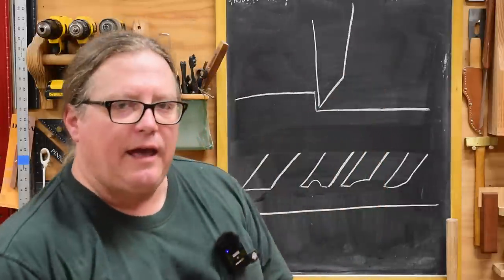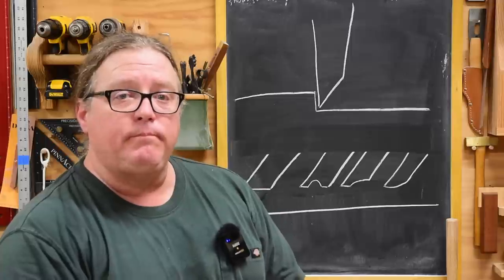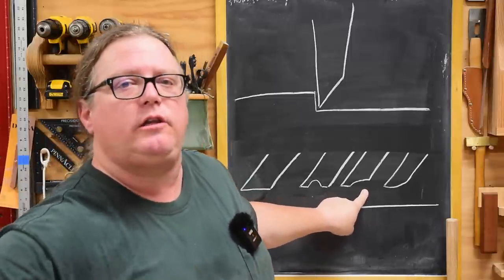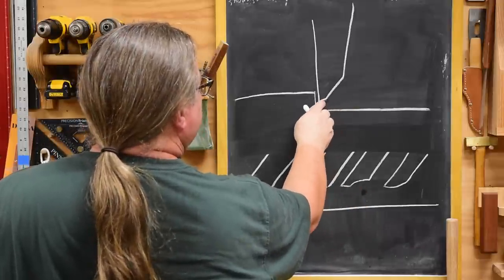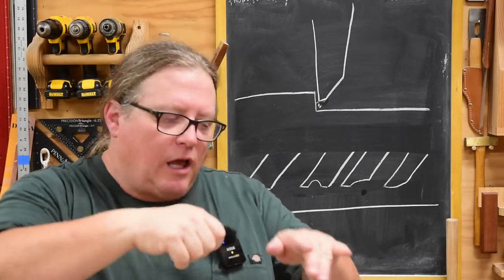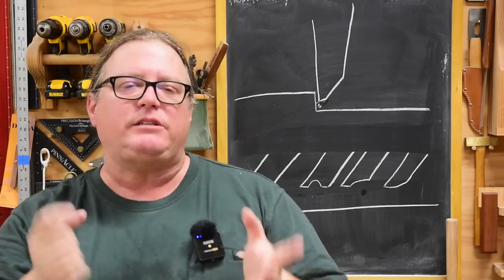We are chopping down. Which one of these would be the best angle? I'll tell you which one I do all the time. That one right there. Though I don't necessarily go to the grinder to get that kind of benefit. I would just clip off the nose a little bit steeper. Just like that. Go to my sharpening stone, find my ideal angle, lift up a little bit, take one or two stripes, just removing the slightest of material.